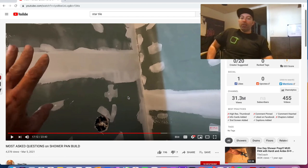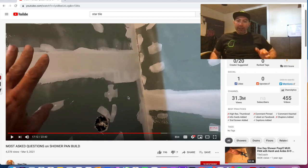You can look it up on Custom's website, pull up the PDF. They don't allow their liquid to go over drywall in a shower. It's not an approved method at all. When you put the tile on, that is not your only defense against water.